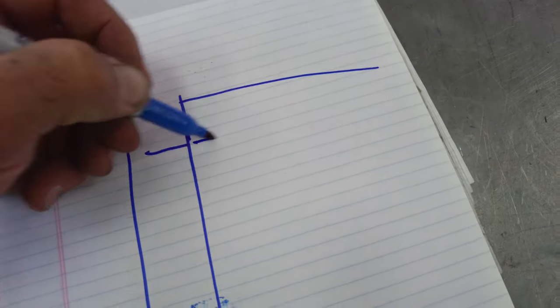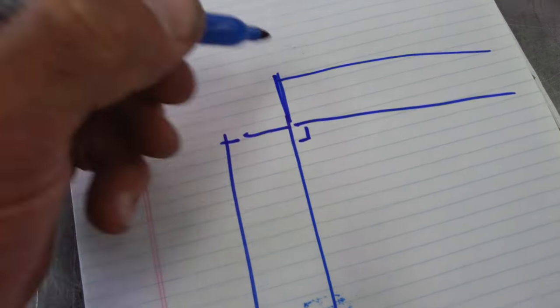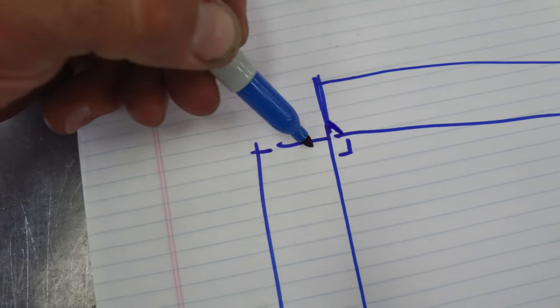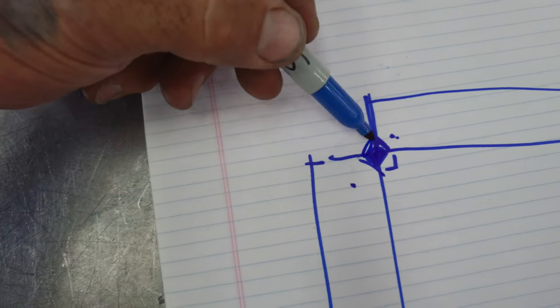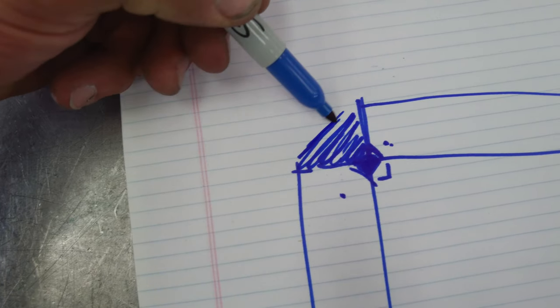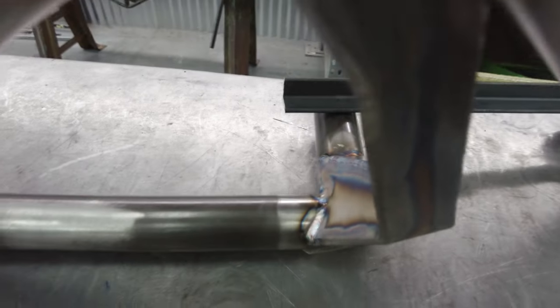All right, just like we talked about in episode one with the root pass, let's draw that same thing. This is a close-up of our plate work, just like a 90 weld. Now we've already established our root, which has bonded the two parent materials and got penetration. And then we've got this root pass pretty much filled up diagonally in these junctions, right? It's that same kind of program. It's a little hard to see.